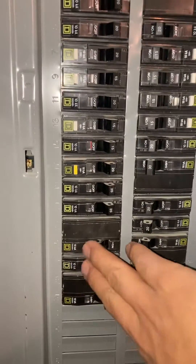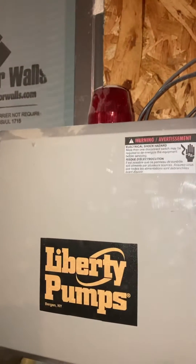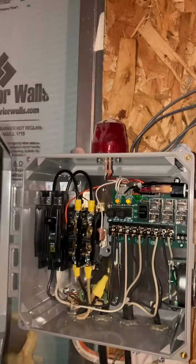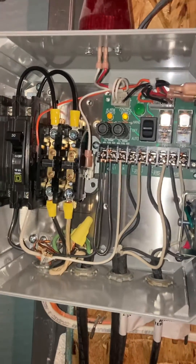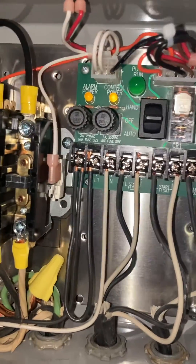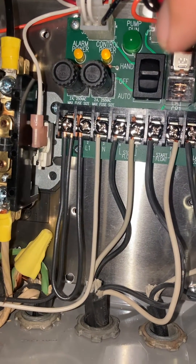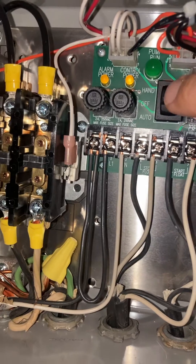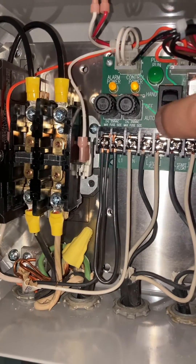You can bypass the floats in this control panel. Obviously you've got to have the breakers on, so my pump and my control panel are now activated. I have these screws undone. When you open this — and be careful, this is not something you want to do carelessly — you'll see there is a switch here that says 'hand,' and it says 'auto,' and it says 'off.' Normally it's switched to auto for the floats.